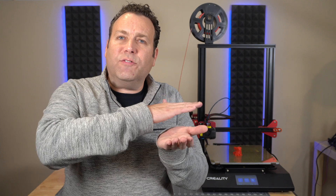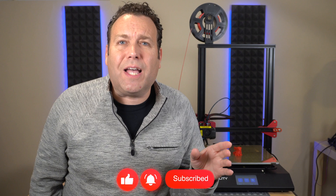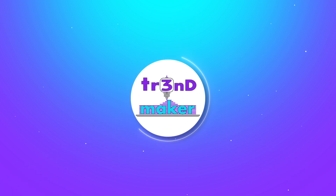You can also do this if you have an Ender or some other printer — you can do this right to the glass. If you want a textured surface, you can put the textured surface on the backside of the glass, and that way you'll have the smooth glass surface to print on. And if you do feel like textured is okay, you can print on the backside but still retain the flatness of the glass. Really great project. Please like and subscribe below — it totally blows my mind and gets me super excited to produce more content. I've got a couple of really cool videos coming up in the next couple weeks. Until the next one, I'm out.